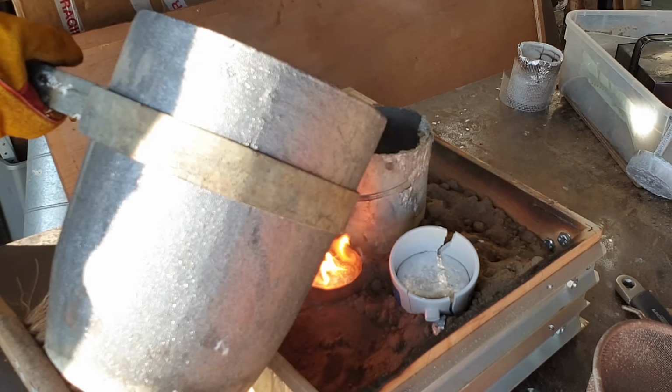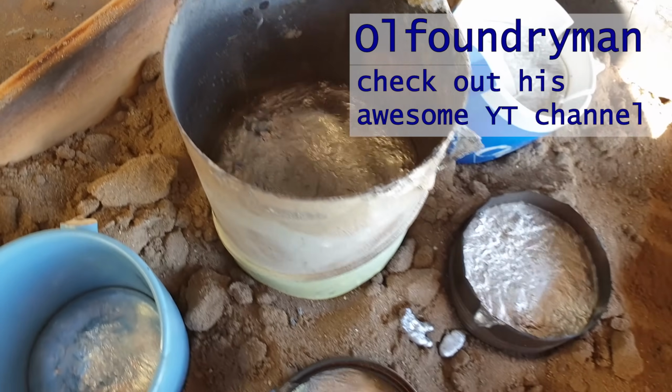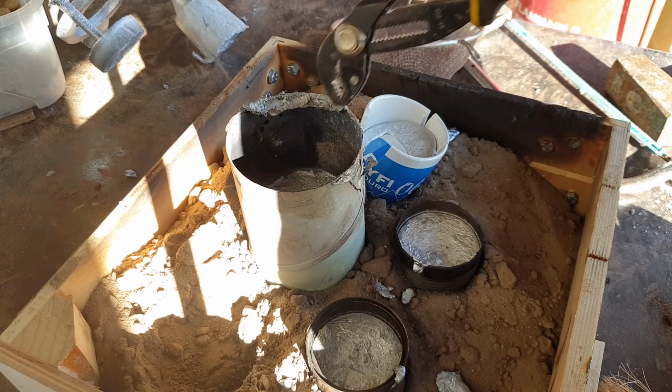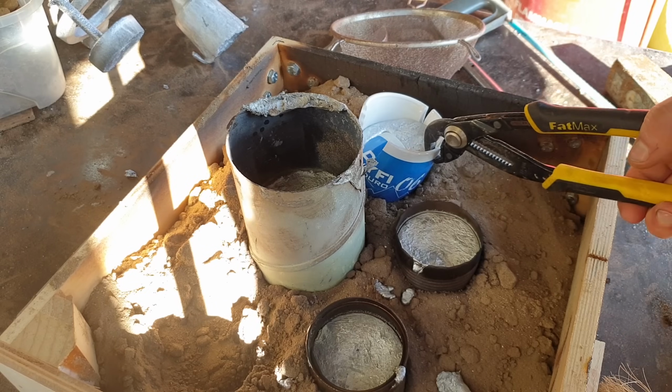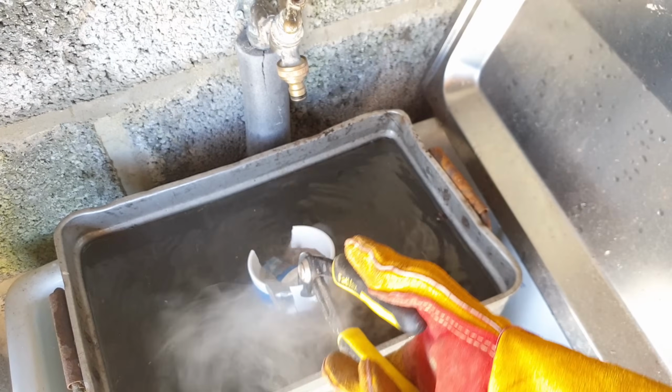Now I've got Martin from Foundryman to thank for this idea, and all I'm doing here is pouring a bunch of scrap aluminium into bean can shaped round stock essentially, which I can try different machining operations on. Some of it will be heat treated, others won't.